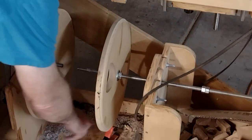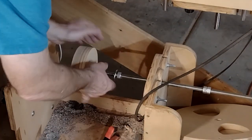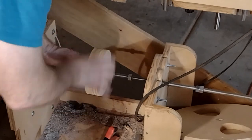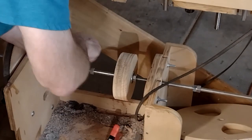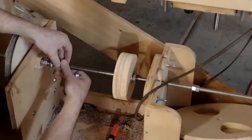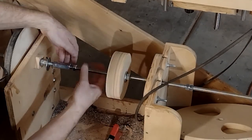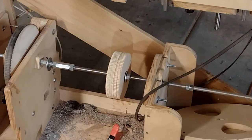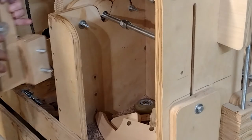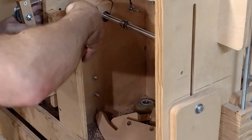I'm going to speed up the film so you can see the whole process. I'll remove the other clamshell piece and then I will put on the gear sprocket used for the timing belt that wraps around the drum so it will rotate the drum. I cut that gear sprocket on the other CNC machine and it works out great — it's nice and wide so even if the belt wants to move a little bit left or right, it's going to stay on there. The next apparatus I'm adding is the belt guide and the belt tensioner — just three bolts hold it on.